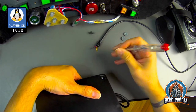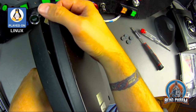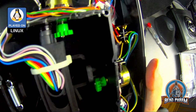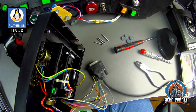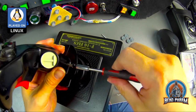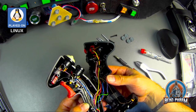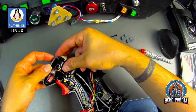I decided to start with the joystick, which was already heavily modified by the previous owner, and the original circuit boards were already gone. Which is once again very sad because the old shift registers were also gone. This means more work for me and the Arduino Pro Micro that I was going to use, because without the shift registers, I'd need a button matrix instead. Or, you know, order some new shift registers, but where's the fun in that?